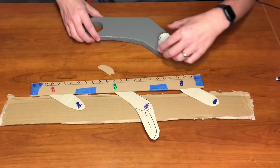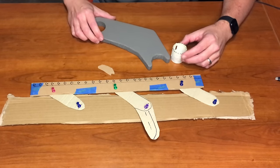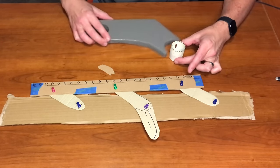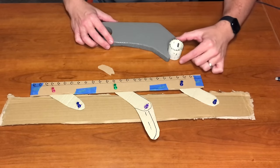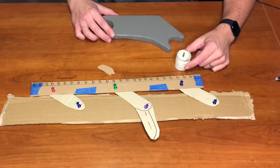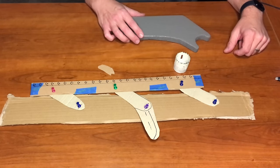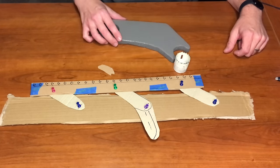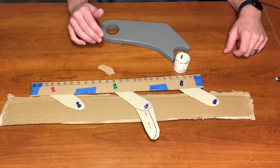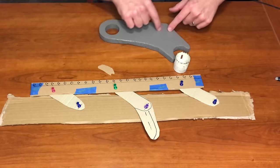Now the dog, in this case, doesn't drop down more than about a chain's length, height. So it's very critical that that's in that area. That way it can lock onto it. But another point is that when the trough drops, it drops about, I don't know, 150 millimeters. It's not that much. But it also has to clear all those links on the way back down. Because if it were to somehow reach down and grab a link on the way back down, it wouldn't feel the best in the train itself, but it would pretty much snap the chain dog in half. It would just tear the steel right across the thickest part.